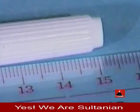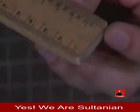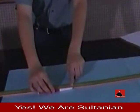When the meter ruler is used, it is usually found that this end is damaged or scratched. In case the ruler is damaged, we should avoid using the damaged markings for measurement. We should select the center portion for measurement.